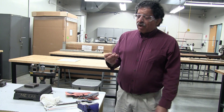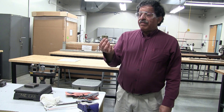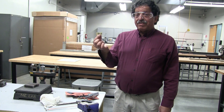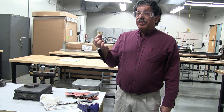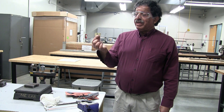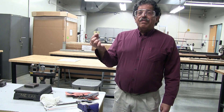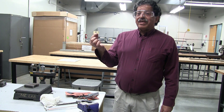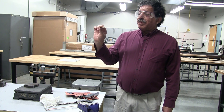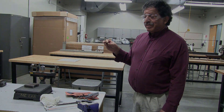For this virtual demo, I'm not actually going to chop the specimen in half with the hacksaw — I'm just going to take the whole thing and stick it into the furnace. After the specimen has been in there for 10 minutes and is nice and hot, we'll cut to the point where we're removing it from the furnace and I'll show you what to do after that. This is a fairly simple lab. I'm going to put the specimen into the furnace that's been preheated to 350°C.